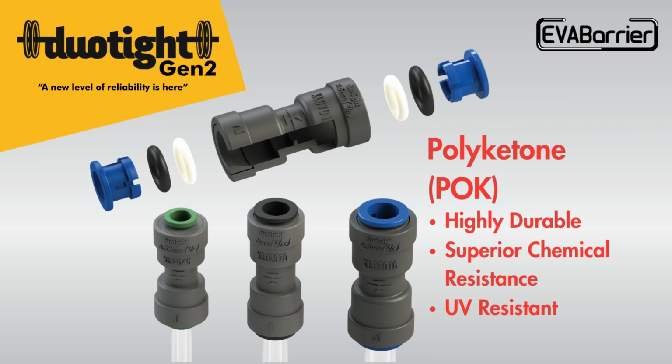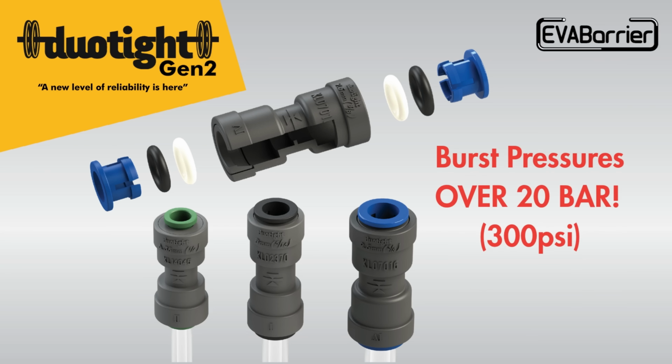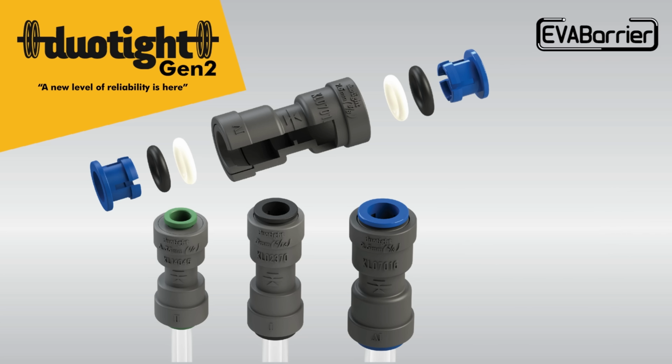The other thing in the Gen 2 range is, because of the polyketone upgrade and some of the design aspects of how we assemble these, they all have a pressure rating of over 20 bar. So that's 300 PSI. That's absolutely massive. Generally, it's even higher if you go to the smaller diameter 1/4 inch or 6.35 millimeter ones. The other thing about the polyketone is it holds really high temperatures. So you can basically have boiling water and stuff like that around these, and it's no problem whatsoever. And lastly, one major aspect we've upgraded is on these Gen 2 fittings, we now use a combination of O-rings in there. Previously we would use 2 different O-rings of the same type.